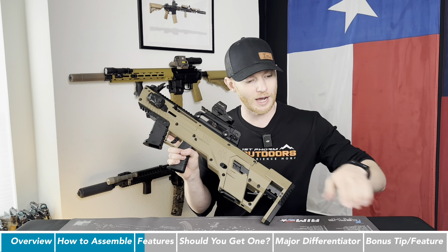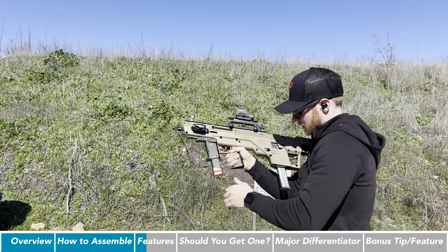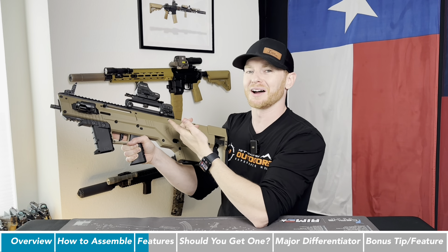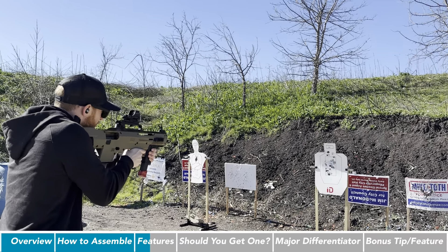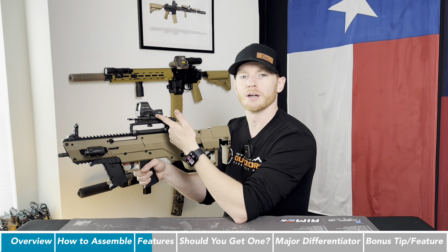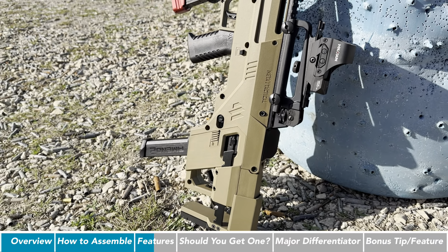Moving through this, you have a little button carved into the frame — this is your mag release. When you have a mag inserted and want to drop it, all you have to do is push that spot and it should free-fall out, because this is just our Glock in there. So as long as a mag works in your Glock, it'll work with this chassis. You have a top rail up here to mount anything you want. I did the carry handle to make this look like a Halo battle rifle. But if you wanted to make it more practical, these are the Apex sights from MetaTactical — I put one in front, there's a rear one you can add. I also threw a Holosun 510C up top, though you could put that right on the Picatinny mount on top, which would probably be a lot more practical.